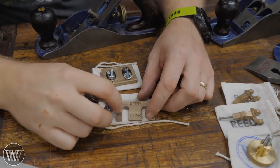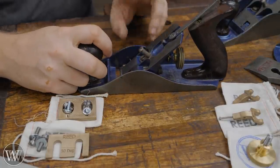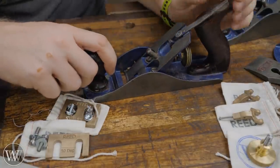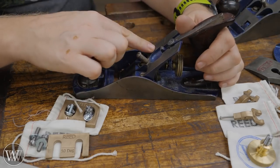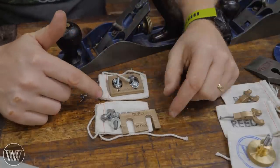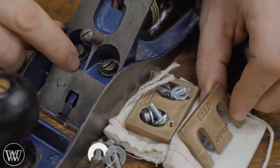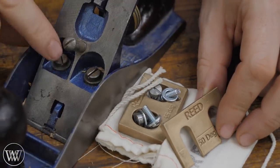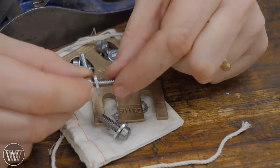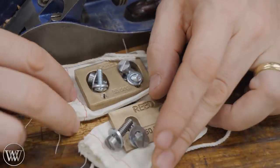That then brings us to these — frog wedges. With a standard Stanley plane at 45 degrees, it will do 99.9% of the work perfectly, but every now and then you come across some weird grain that starts to chip out, and it'd be nice if you could raise that frog just a little bit higher. You can buy replacement frogs, but those things are expensive. These will allow you to move a standard frog up to 50 degrees or 55 degrees, or actually a little bit more, depending upon how far you push the frog in and out. This is the 50-degree wedge — it slides in there, and then you take the screws out of the frog. You can generally use the old screws, but sometimes they're not quite long enough. Reed also provides screws that are more than long enough, so you can file or cut them down to fit your size exactly, because many Stanleys have different sizes. These had to be individually turned, so they're very high quality and absolutely beautiful screws.